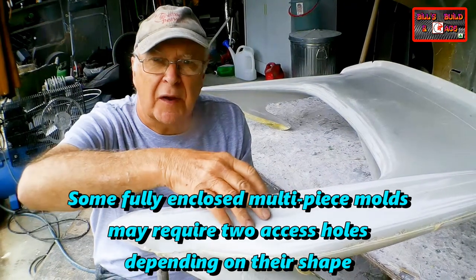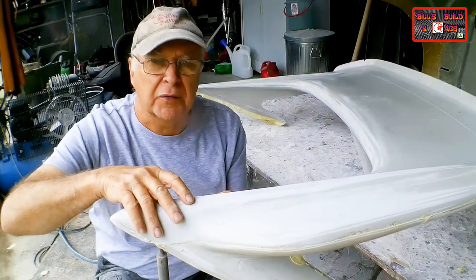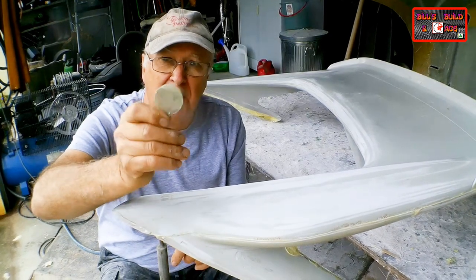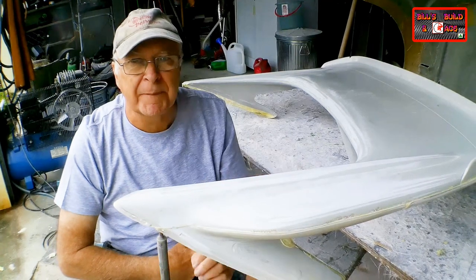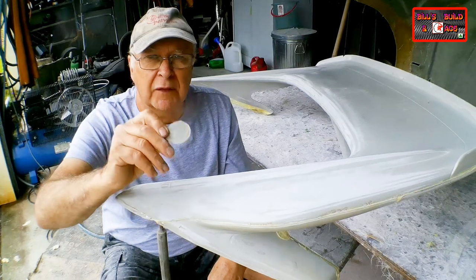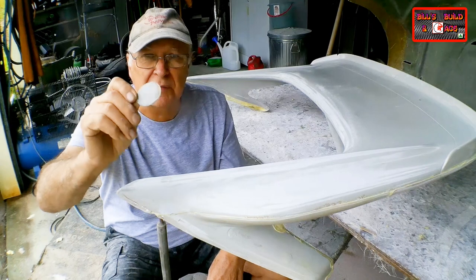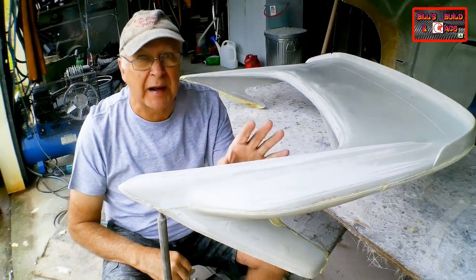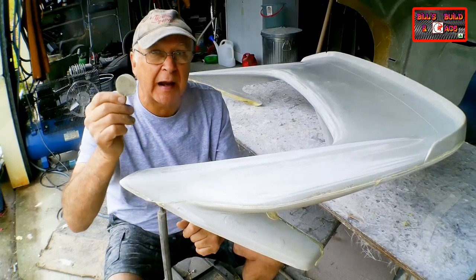Then when the foam is hardened, you take the part out of the molds, trim the excess foam off, and then you take the piece of fiberglass that you've drilled out and you glue it back in place and you bog it. That leaves your mold with a hole in it, and you do the repair to the mold the same way. You keep the circle that you've drilled out, and you just put that in position while you're making the parts in the mold, and then to pour the mold with foam, you take that plug out. Got it?